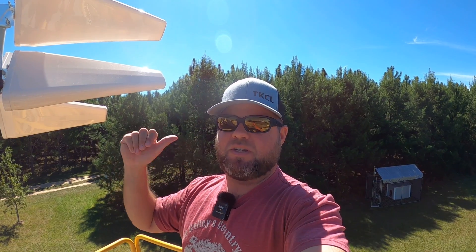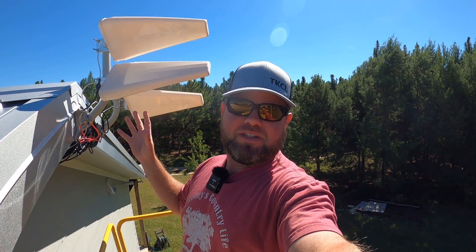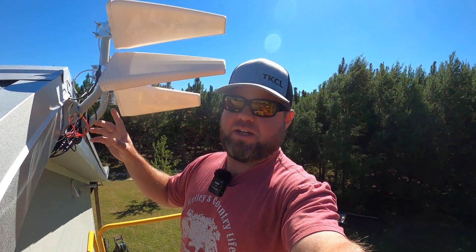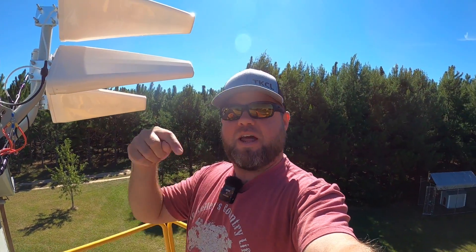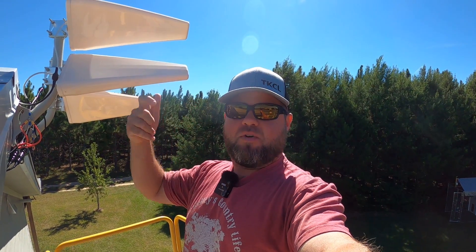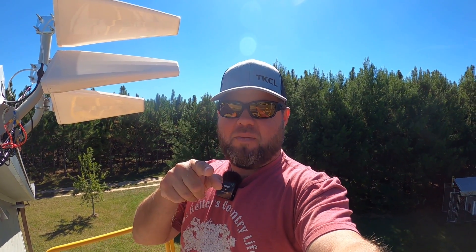I really don't know what to expect today. The panel antennas are less amplified, so technically they have less of a chance of giving me better signal. But when you look at the way my signal is being disrupted everywhere, they potentially have a better chance of collecting more reflected signal. I'm about to pull all this down. I know the tower I need is right over here based on the lookup sites linked in the description. We're going to aim the panel antenna roughly the same direction, log into my router, look at signal strength settings, and run a few speed tests.